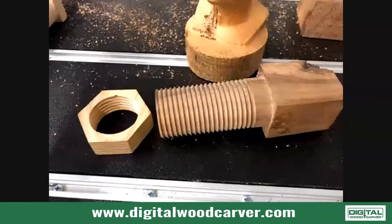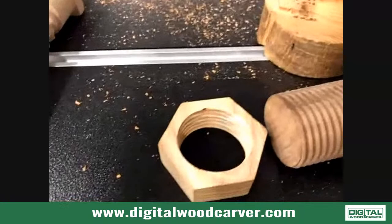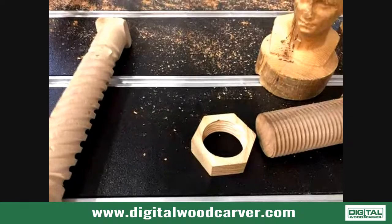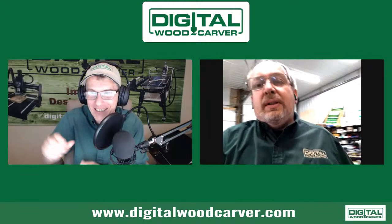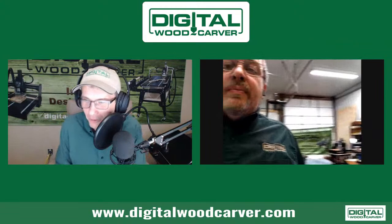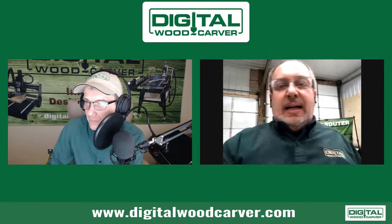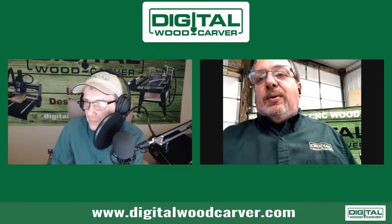And then the nut was actually carved on the table, the CNC table, using a side V cutter. It's a thread cutting bit. Basically, think of a V-bit that cuts out to the sides. It does a pocket cut, cutting the threads for that. And so that's a very cool project. Perfect, Burl, for making things like end vises for workbenches, you know, the threads and stuff. Yes. Games or something where you got to thread and unthread things, parts that fit exactly together. Yeah, everybody likes wooden threads. I've seen them in offices as name pieces and stuff. And I'm grabbing a thread cutter bit so that you can see what that is. I'll show everybody here in a minute, and then we'll show a final picture.